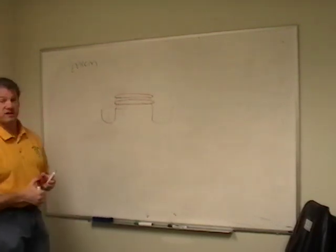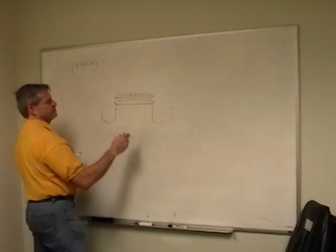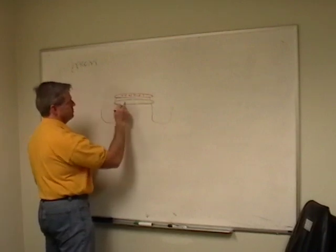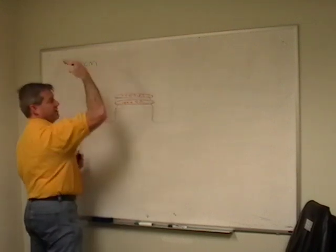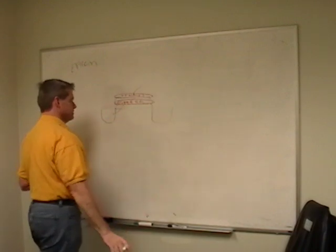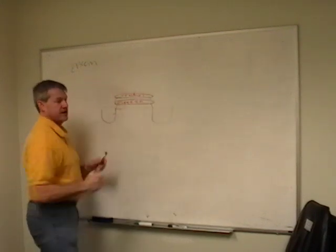And the programming voltage was like 15 volts. So what you would do was put a big positive voltage on here, 15 volts, while everything else is running at 5. What that allowed was hot electron injection. The electrons get so much energy that they can tunnel right through this field oxide. They're pulled by that electric field up into here. Some of them actually make it through and leak out, but a bunch get trapped here. Then when you remove this, you've got all these electrons stuck here and you have a bias. And when you put your 5 volts on this gate, these reverse it, null it out, and you don't read out of this memory cell.